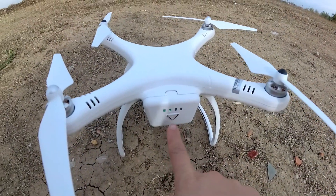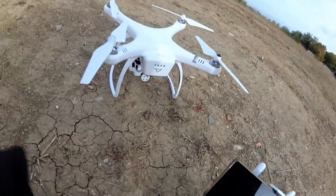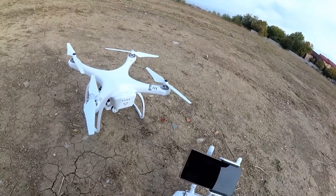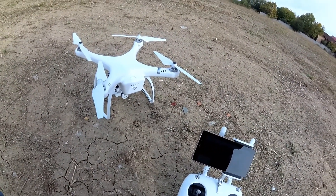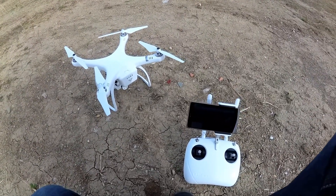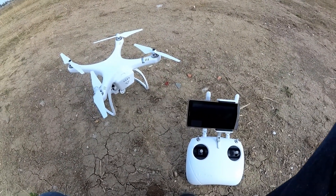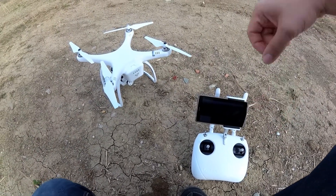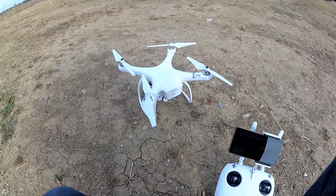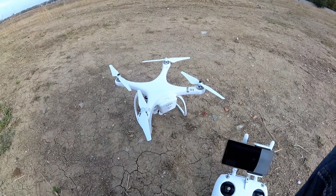As I've landed, the battery gained one more LED - it was at just one LED, so that's the voltage sag issue I was telling you about. But it's not a really big issue if you correlate the voltage sag with the state of charge and flight time - you will always know how much flight time you still have. And actually I like that it shows less voltage, because if it didn't show the voltage sag - which is rather large - and you were too far away, you probably wouldn't be able to make it back.